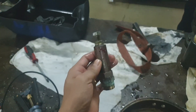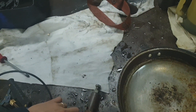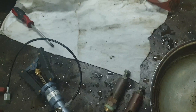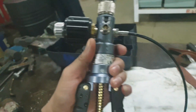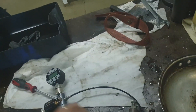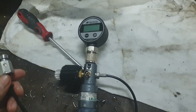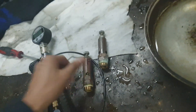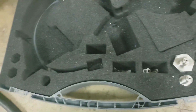The opening pressure for the low pressure side is 7 bar. We connect some fittings to these valves — the same as we did for the high pressure safety valve. Just connect the fittings to the safety valve and operate. These are the first stage, or low pressure, safety valves.